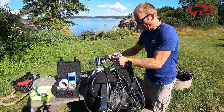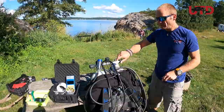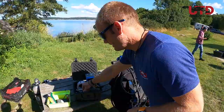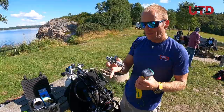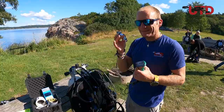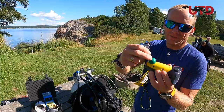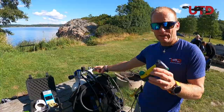And now we're getting ready for analyzation. If there's some moisture in there, quickly purge it out so there's no debris. Then we come to the part that makes a difference: some analyzers have a fancy flow limiter like this one, which makes your job a lot easier — you just put the flow limiter inside, open up the valve, and it takes care of the perfect flow the analyzer needs. A basic type like this doesn't have a flow limiter, but requires that you adjust the flow on your cylinder a little bit before analyzation.